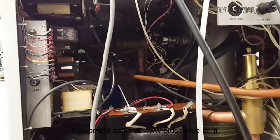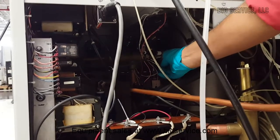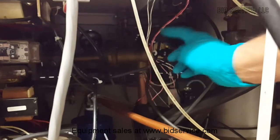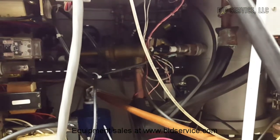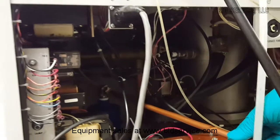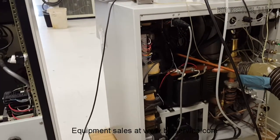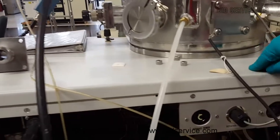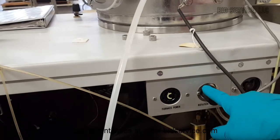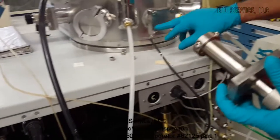The cold cathode sensor is over here. During shipping the magnets will be removed from the sensor and shipped in a separate bag. The magnets have to be placed on the sensor tube, and the high voltage and ground connections have to be connected to the sensor. Once the magnet is placed, the sensor will read the high vacuum. This is a vent port for the mechanical pump. This system can be retrofitted using sample heaters — this port can be used to power the heaters. And this is for the sample rotation motor power.